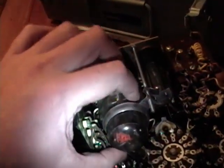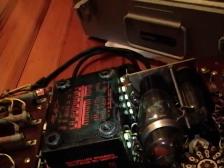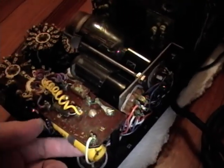I'll unscrew this ring and get these tubes out to test them. As for the capacitors, there's really only one major one here — a one microfarad 600 volt paper cap. It looks fairly old but in pretty good condition; it may have been replaced years ago. The resistors all look original — tapped power resistors for various ranges, plus some trimmer resistors that need to be tweaked to calibrate the device.